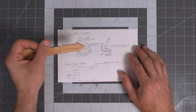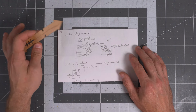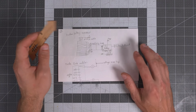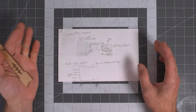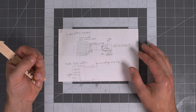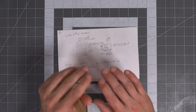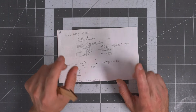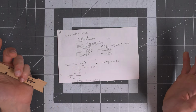If you overcharge lithium, it will damage it. Even lithium iron phosphate, which these NexCell packs are, they're LFP packs, those are not safe to overcharge. Now, LFP is safer than an NMC, like a standard lithium polymer or lithium ion battery. When someone says a lithium battery, they're typically talking about NMC, and they will further specify if it's an LFP. And again, this is an LFP module, so it is safer to overcharge and undercharge because the failure mode, which still exists, is not going to be a runaway fire usually. It's not guaranteed, even with LFP. With NMC, if you overcharge it, you basically have TNT in your car. It's going to burn to the ground. Everyone's seen videos of that.